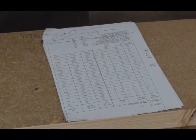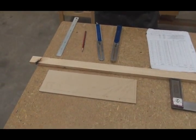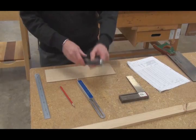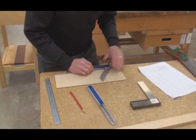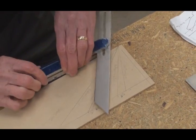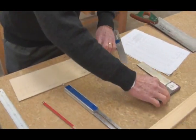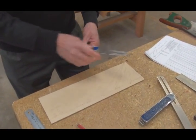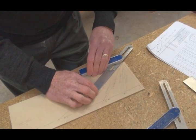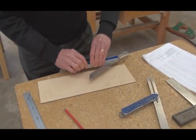In this case we'll be using a roofing table. The ratios on the roofing table are transferred to this bevel board. One bevel will be set to the plumb cut — be sure to set it accurately, tighten it up and check it. The second bevel is set to the seat cut. Again we set it accurately, tighten it up, and then check it.